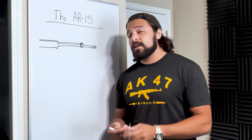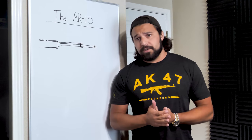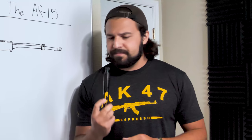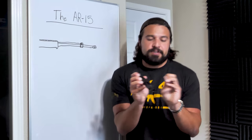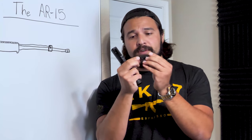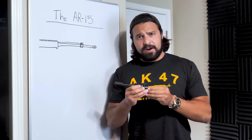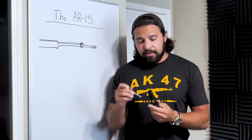This is what makes it direct impingement — ish. The gas is coming up, being channeled back, and directly impinging on the bolt carrier. The gas from the gas tube feeds through the upper directly into the gas key. This actually feeds gas into an expansion chamber inside of the bolt carrier and against the back of the bolt — which is why you have gas rings on an AR-15 bolt. It builds up gas pressure inside the bolt carrier, pushing the bolt against the bolt carrier, causing it to cam, which unlocks the gun and allows it to cycle. So in a roundabout way, it is actually using the bolt as the piston.